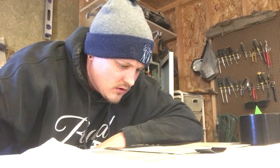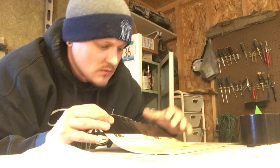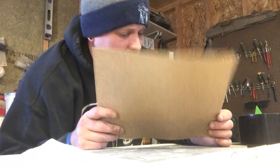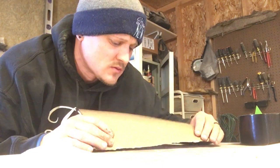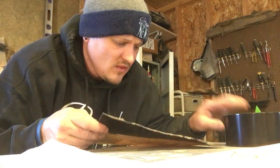I'm going to give you guys a little tutorial on how to do this, in case you ever have to touch up, sand, or repair any spindles of your own. Basically, what I have is a regular sheet of sandpaper — I'm using 80 grit on this because it's got some pretty thick varnish I need to get off. Then I'll go back and sand it down with 120, then 220, to get a smoother surface for staining.